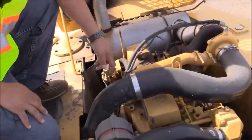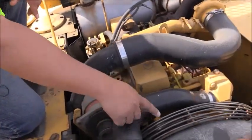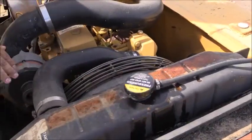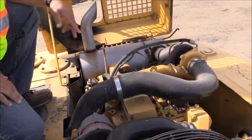From inside the engine compartment, we're going to check our oil, our hoses, our belts. Make sure there's no debris in the fan. You're going to check your radiator, make sure that you have radiator fluid. Do an overall look of the engine and make sure that nothing's out of place, leaking, or has any wear and tear or broken parts.